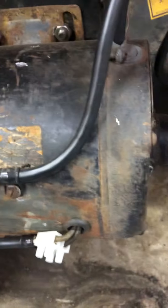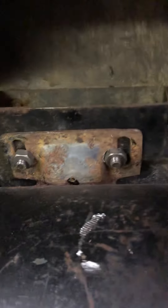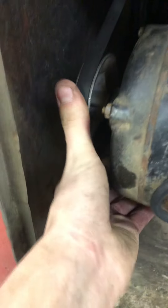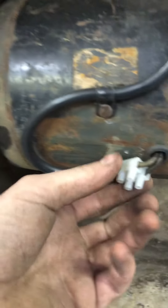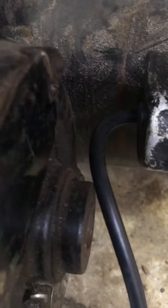It never had a motor on it — I don't know what motor it had. This is a half-horsepower Century motor. I had to make a little bracket for it. The belt that came with it fits nice and tight. I had to use a capacitor here — it was mounted here originally but it was too far and hit the cover. So I put a little terminal strip and strain relief on this table, drilled a hole in the end of that, and ran the capacitor on there.